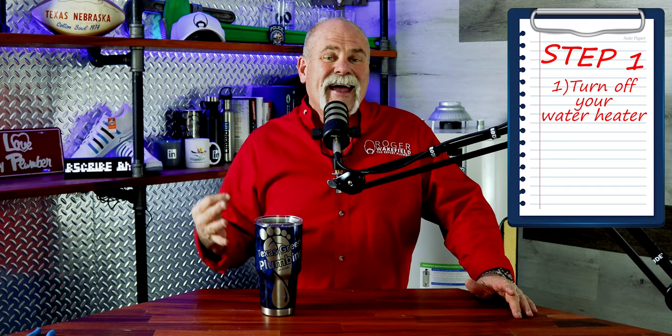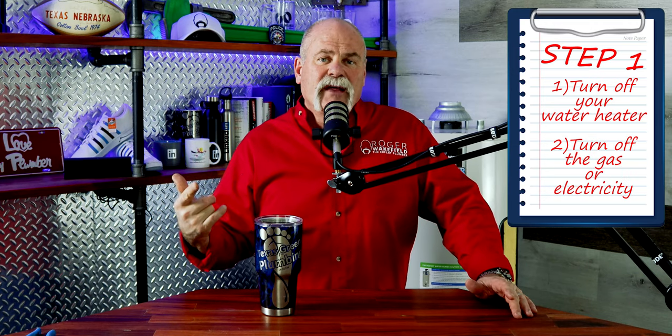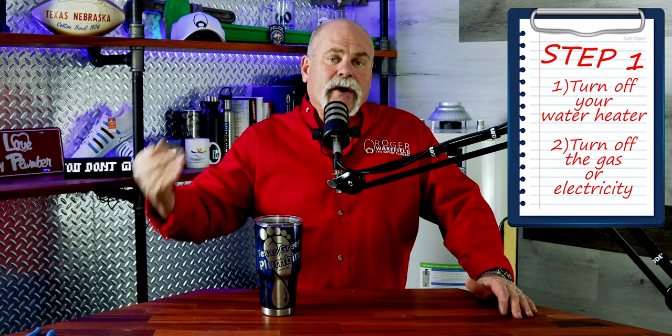Now, some of these are really easy. First of all, you need to turn the water off. Step number one is turn the water off your water heater and turn off the gas, turn off the electricity, however your water heats, because you don't want your gas to kick in and heat that water up while you've got the top out of it. So that's really the first step. Know how to turn everything off.